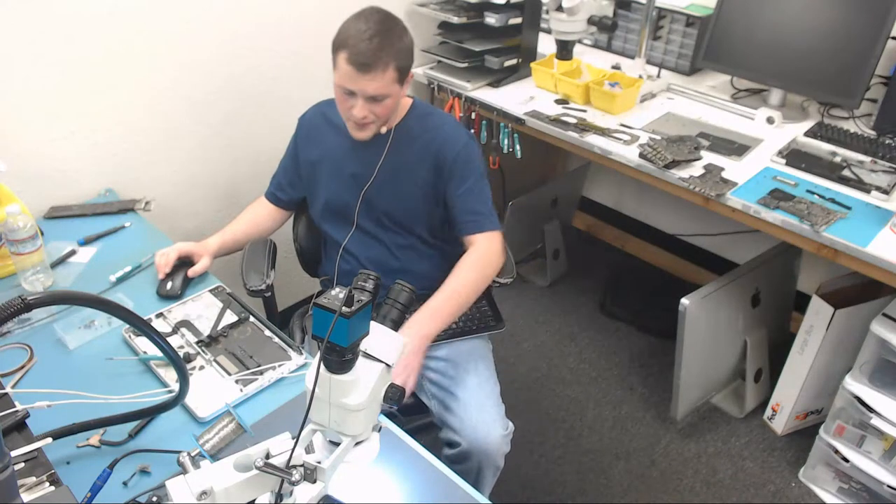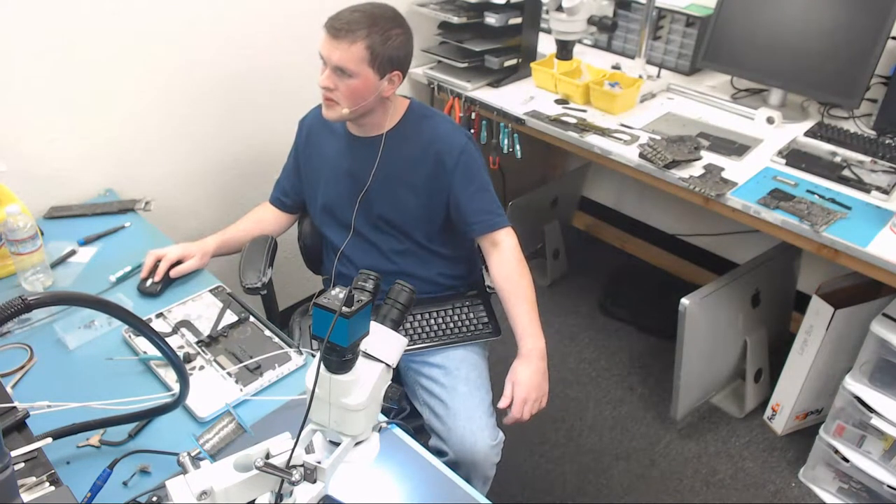Let's put this in the oven to bake and get rid of all that water, and we'll see if this works. You can also blast it out with canned air. After replacing stuff, it'll probably get an ultrasonic again for just one or two minutes per side to clear out any other corrosion. Regarding MagSafe wires: yes, there is a ground and a positive. The ground is like the shield — you'll know what's what when you open one.